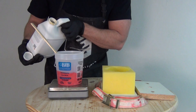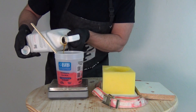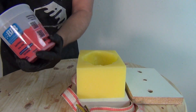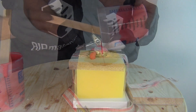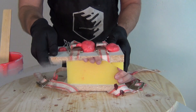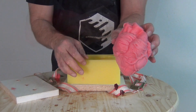As soon as we add our part A, that's when we need to make sure we get everything mixed up thoroughly, accurately, and immediately poured into the mold. It's also really important to remember that because this reacts so fast, especially if you're hand mixing, you don't want to scrape out the bucket into the mold. If you do, you could wind up with uncured or improperly cured spots in your finished foam part.